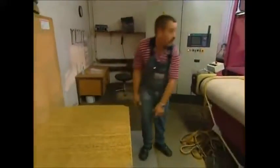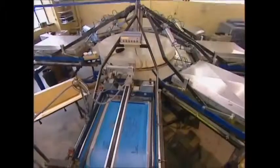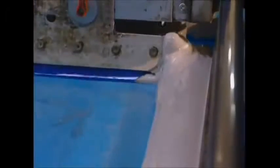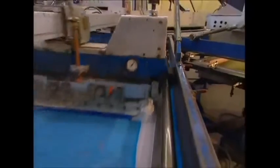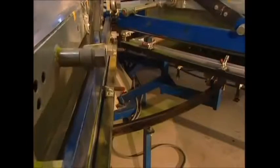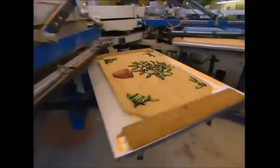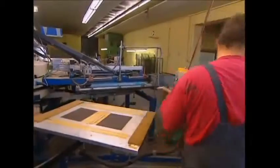Popular designs range from a big welcome sign to the colours of your favourite football team. The logos will be applied here. First, a layer of glue is laid down corresponding to the desired shape. This is then followed by several different layers of statically charged coloured flakes. The flakes stick to the glue and a picture eventually emerges. The static helps attract dirt from the user's shoes, so even the picture on the mat helps to keep your house clean.